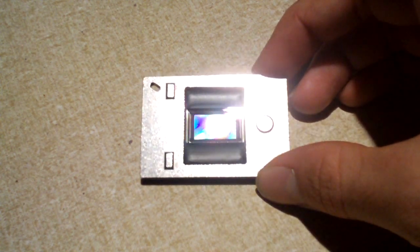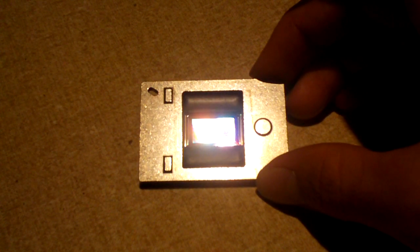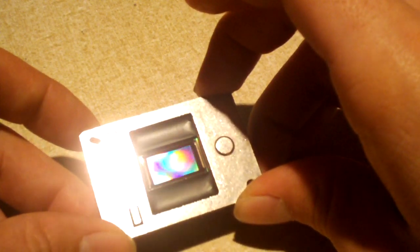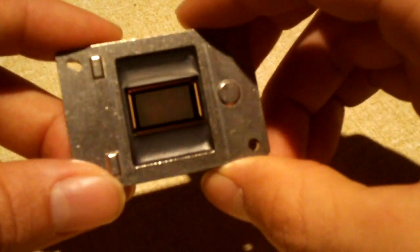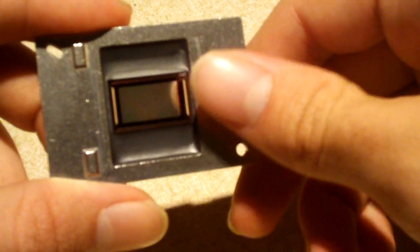The problem is your DLP chip. As you've heard in many commercials, DLP chips have millions and millions of tiny little mirrors that put a picture on your screen. These mirrors turn on or off — when they're on you see a white dot on screen, when they're off you see a black dot. Over time, though it isn't very common, the DLP chip can fail: the tiny mirrors get stuck. This shiny part of the chip is where the mirrors are, and it's the part that displays everything on your screen.